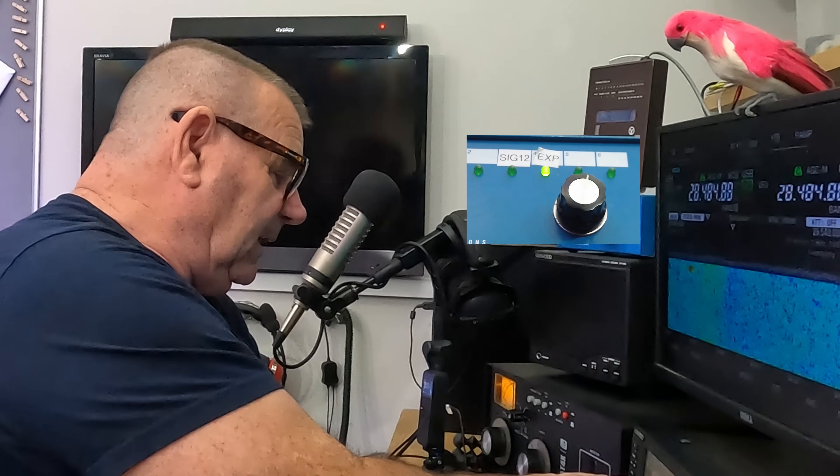What about the 20 meter band? I've got negligible SWR on the Signature 12.4, but on the Game Master it's very high — probably 10:1 or something like that. I can hit the tune button and force the radio to ignore the mismatch, but the mismatch still exists. Finding a signal on the 12.4 — loud and clear — and switching to the Game Master: he's not there. Just because your antenna tunes on 20 or 40 meters doesn't mean it's any good.